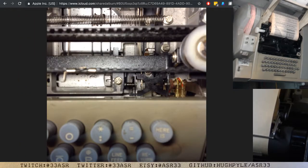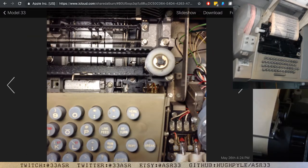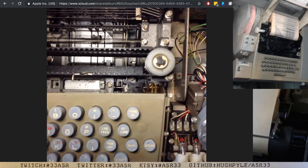So, is there a date stamp on the end of the motor? Because that's where my date stamp was. Yeah, and here the H plate that's in the middle, you can see down beside the little screw, that rocks backwards and forwards. And if the alignment is wrong, then you have to adjust it, like between the keyboard and the printer. There's a slightly subtle alignment. Yeah. So tripping the H, there's an alignment thing that is how the keyboard releases when it's cycled through and goes to the next character. And the alignment can be a bit subtle, and I could never get it right, but then Wayne fixed it for me.